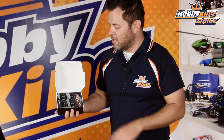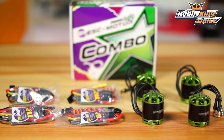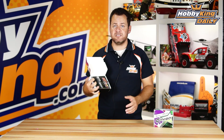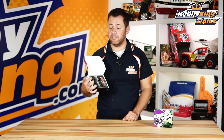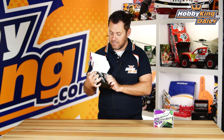The next combo is the 2216 800KV paired with Afro 20 amp ESCs. We went through our sales history and determined the most popular motor for the bigger size range — your 450 and 500 size quads — and it was the 2216. The 2212 was in there as well, but most people upgrade to the 2216 later when they need more power or are trying to fly a camera package. We went with 800KV because it's four cell and three cell capable — all you have to do is reprop. We've paired that up with the 20 amp Afro ESC.